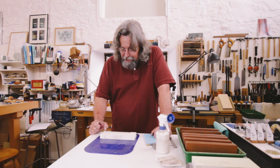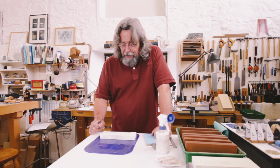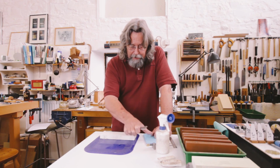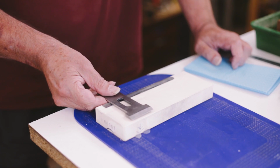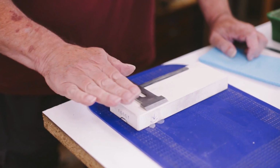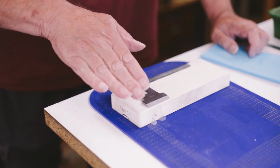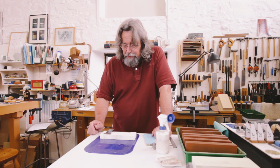Now, I use a particular kind of ruler. It's a narrow ruler, as you can see, and it's 0.5 millimetre thick, 0.5 of a millimetre. And I've done some trigonometry, and when a blade is sitting propped up on the 0.5 mil ruler, the angle that we impose on the back of the blade is 2/3 of 1 degree, which is really very little.